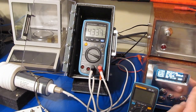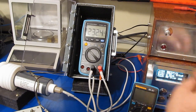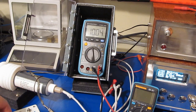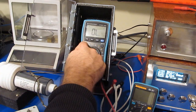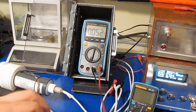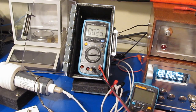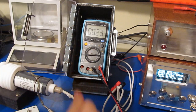Alright, that's it. Let's just see if some basic functions work. So here's the AC volts, that seems fine. DC volts looks fine. It's with our 115 millivolt. This is our 10 meg. There's a 0.5 ohm. Continuity test. Single diode. Capacitive mode. Here's 150 picofarads. And this will be our thermocouple. Looks fine. So I'll go ahead and finish functional testing this, but it does appear that this meter survived where the ZT102 did not. So pretty impressive.